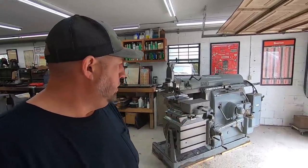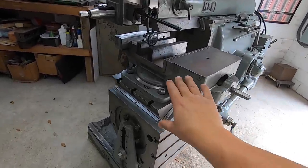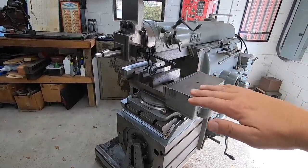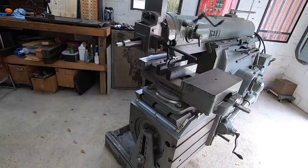I've been doing a little bit of organizing in here in the shop, moving some stuff around. So I'm getting ready to do a little work here on the shaper. I thought I would point something out and go ahead and share this with you. Ever since I started using the shaper and anytime I show some closeup shots of the work being done, you can usually see the shaper trying to move slightly, just up and down. A lot of people mistake that thinking that the vice is moving or the table itself is moving under the load of the cut.